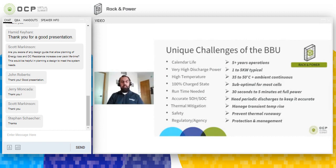Before we talk about design options for a backup battery, let's discuss some of the unique challenges with batteries for data storage applications. BBUs have very long calendar life requirements — typically starting with two years in storage at elevated temperatures and then five years operational. We need to find cells that can survive that long and still provide enough energy to handle a backup event at end of life. BBUs also require very high output power; some firehose dumps can require up to 5 kilowatts from one BBU, so we need cells designed to handle that.